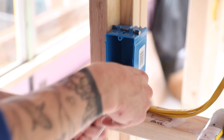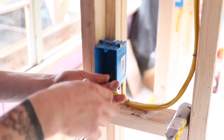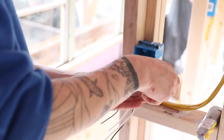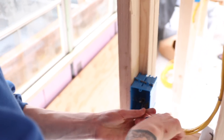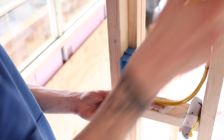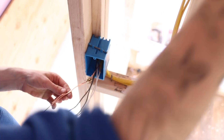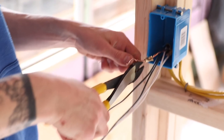I always like to start with the grounds first. When you have multiple grounds, you have to make sure they all come down to one because you only have one spot on a switch. With the crimp sleeve, give the wires a bend, give them a spin to tighten them together, put the crimp sleeve on down to where they're tied tight together, get your crimping tool, and give it one good squeeze. Keep the tail kind of long — this is what's going to tie onto your switch.